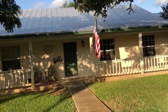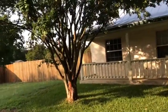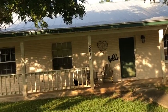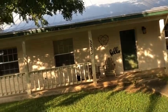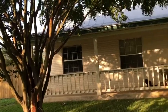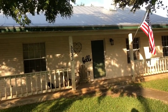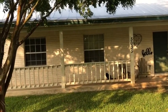It's really going to make a difference with the look of the house, getting all this vinyl off and getting some Hardie plank on there, with a nice wood grain texture to go with the country, ranch style house. It's going to be a really nice change. So we're doing a full tear off of all the vinyl and the aluminum on the fascia. We're going back with the cedar mill select 8 1/4.